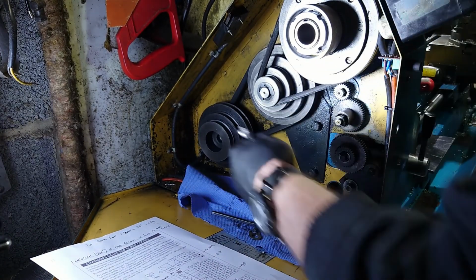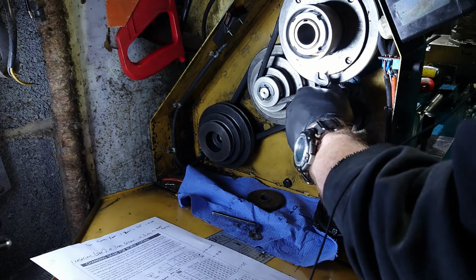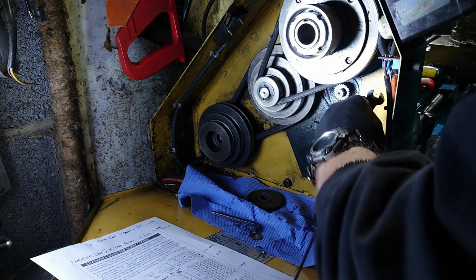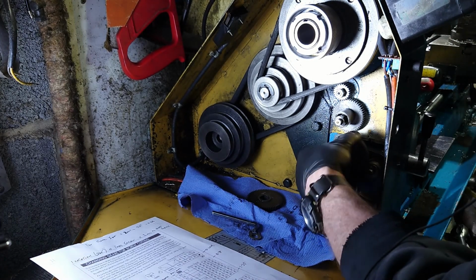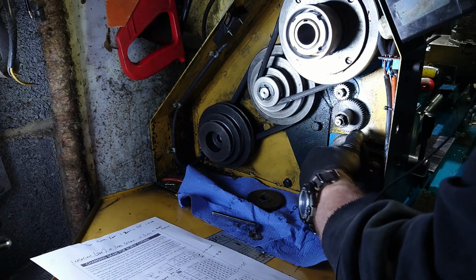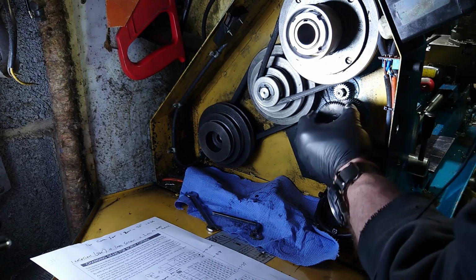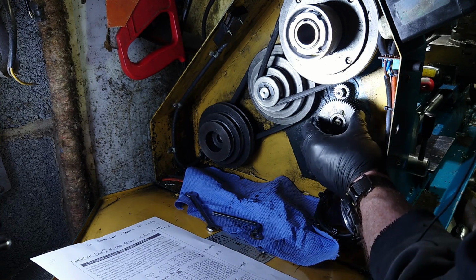So, getting the mesh right on these two. It's an 8mm head, and then you just move it in so that they engage. You don't want them in really hard together, but just so that you get a firm mesh. There we go. I might have to go and get some new gears. Maybe these are getting a little worn now. Right. Anyway, last one is the top one, which is 63. I'll put that one on there. Oh dear, my eyesight's getting worse, you know.